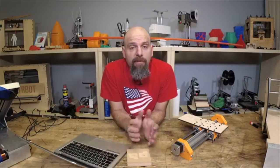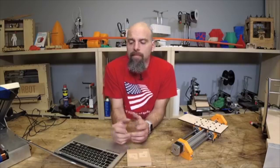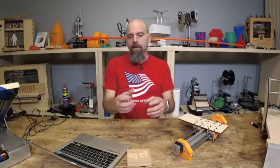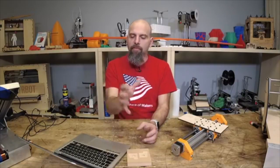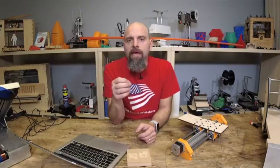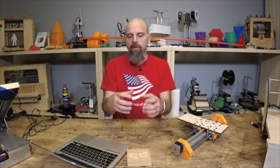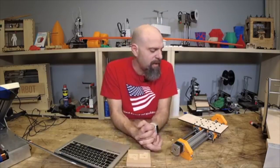And you don't have to, so you could switch back and forth between your regular extruder and this one. In fact, you could even bolt it on there like a little quicker mount. Instead of removing the extruder from your 3D printer, you could bolt it onto the side or something, maybe with a 3D printed part, so that you could just have it beside and then use it together, or some magnet mount or something like that. So that would be cool. You would need a motor, and then you'd just be plugging things into the board and switching the steps per millimeter. Enough on the paste extruder.